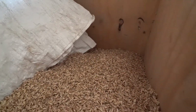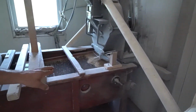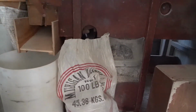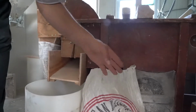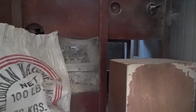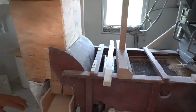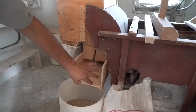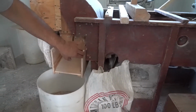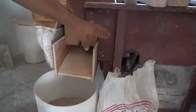And then where does the grain come out, the cleaned, dehulled? The clean grain falls down through, and then there's a fan there blowing air up, and the grain will fall down through the air column, slides on down, and we put this box underneath to catch the finished grain. So as it is running, there's always clean grain falling out the bottom. And this air column is also blowing up through the grain. We blow it hard enough that it picks up the lightest kernels, any kernels that fall down through that are not dehulled, and it'll blow them up here.